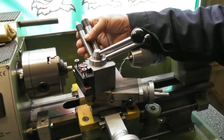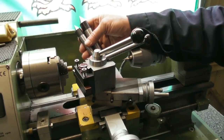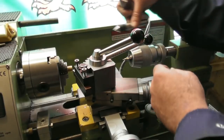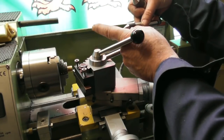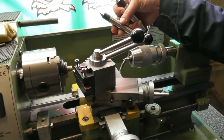When I bought the lathe and the accessories, it came with two dead centres, an MT3 and a Morse Taper 2. For my tailstock die holder, I want to mount a Morse Taper 2 in the tailstock, in its normal method. But I want a piece of probably 1/2 inch diameter pin on it, maybe 3-4 inches long, in one piece.